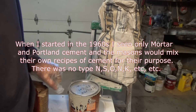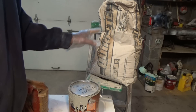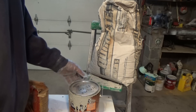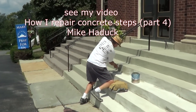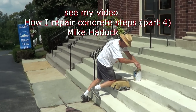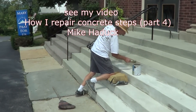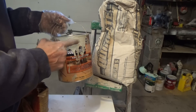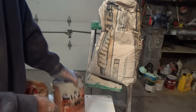Now, you can see in my videos that I approach a lot of different jobs in a lot of different ways. If you go to my 'How I Fix My Concrete Step' videos, you'll see me using regular Portland cement or different types of cement. Then I'll go and buy a paint and paint it, because cement isn't waterproof — I don't care what they tell you. You never see them use mortar in a concrete pool; they always use Portland. What I do with steps is I paint it, and you might have to go over it every year.